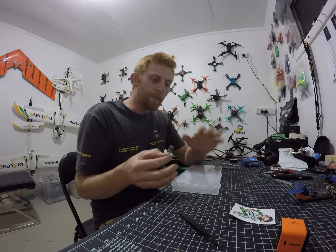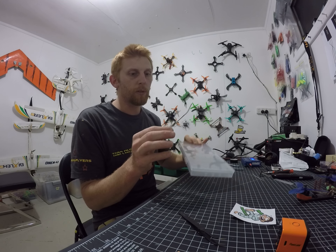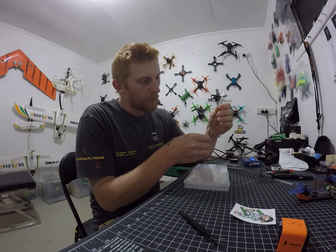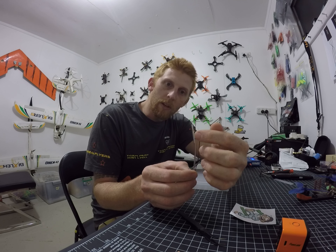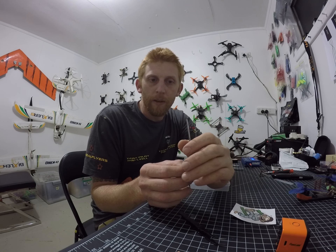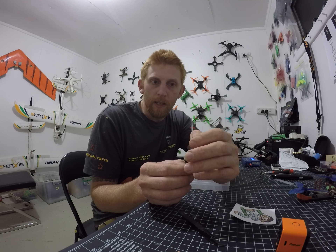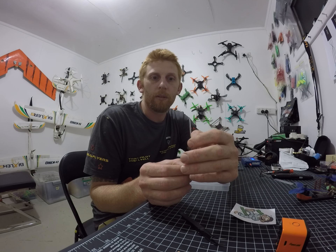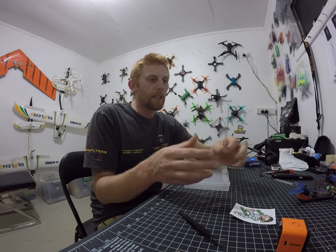That's just a little tip. This kit has the awesome sizes you need to make your FPV build so much better, and it's really user-friendly. I don't heat shrink these antenna covers down — mainly what they're for is so that I don't damage the tip, because it's so thin and it breaks off where the black coating is. The antenna has a wire centre, then an earth around the outside, and then a black heat-shrink-style outer coating. That just stops it from getting beaten around or blowing in the wind and getting damaged. That's an awesome little idea and I just thought I'd share that with you guys.